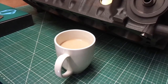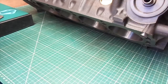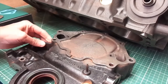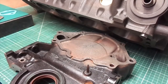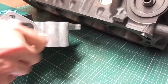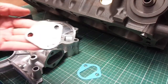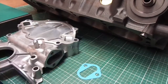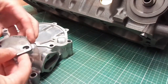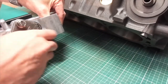Intermission — cup of coffee. Right, get the engine in. That's not getting the engine in — that's the old timing cover, the one with the spike that's going to spike me. I think I'll clean it. Obviously it's a new front cover, aluminium. What I'm just showing you there is the blanking plate. There was a mechanical fuel pump which ran off the cam, off an eccentric on there which moved a lever up and down, and that lever came out into the fuel pump. I'll be using the original Stuart Warner fuel pumps for this, so it's blanked off with a blanking plate.